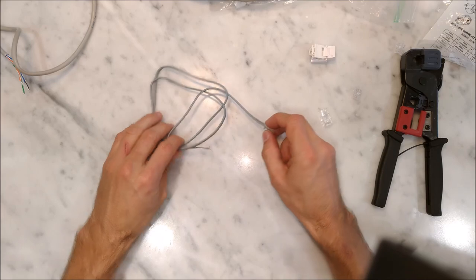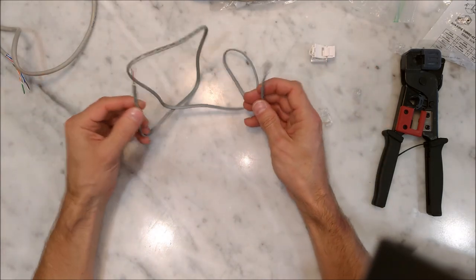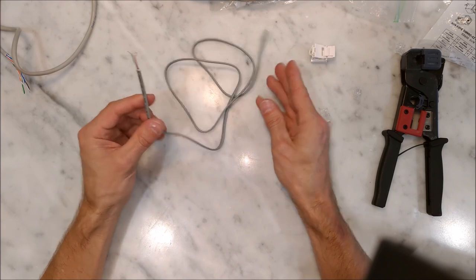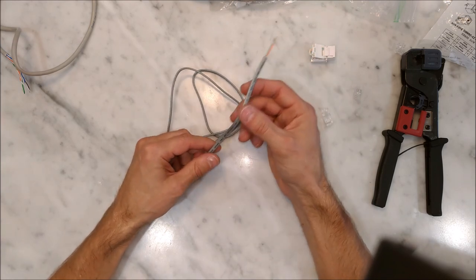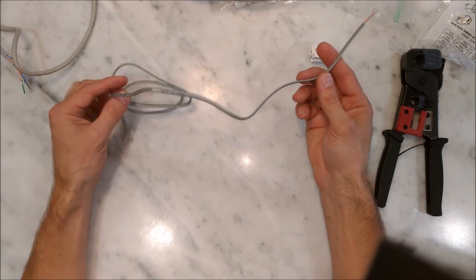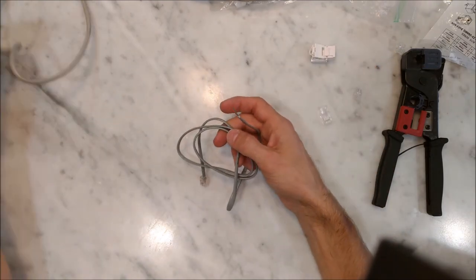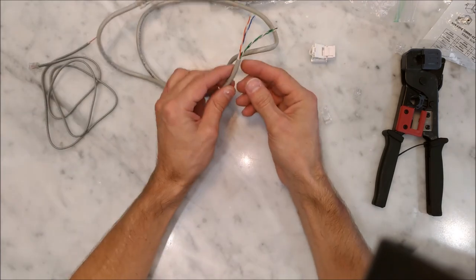So what exactly am I going on about? Well, this is telephone wiring that most people think of — this is two-wire, but they also make four-wire. Most people think this is what's in their walls, but this is not normally what's in the walls. The reason is when the wires are parallel like this, over long distances you get a lot of interference, so these kinds of wires cannot be run very long distances in walls. Thankfully, most homes have this other kind of wiring in their walls instead, and that kind can be converted to network wiring.